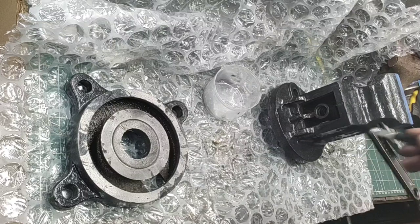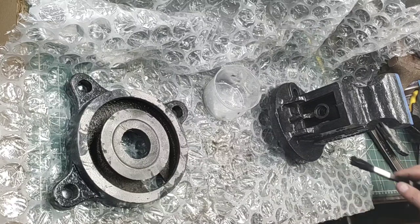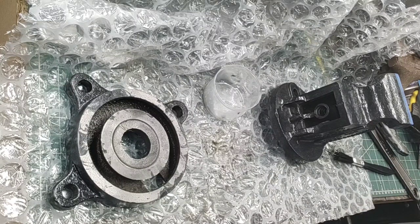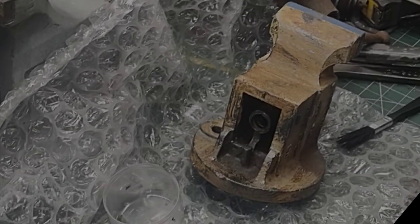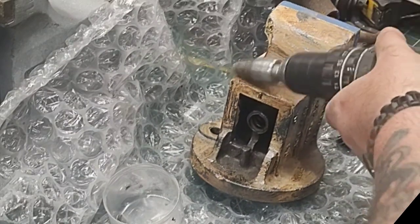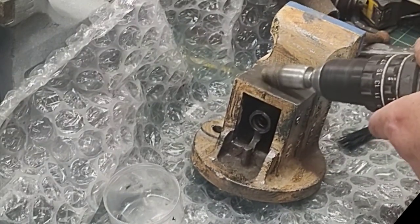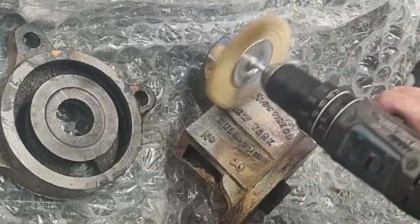It's come out great. To prove a point about Super Blue, I left this for 40 minutes and look what happens. But underneath the new, very light coating of rust, it has darkened the metal just as I want. So let's take this rust off, then it'll be time to get some wax on.